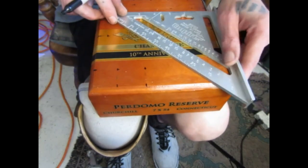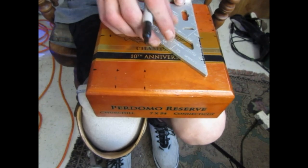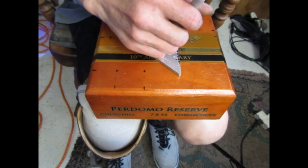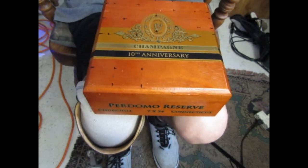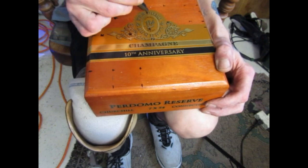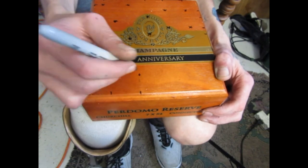When you're done it's always a good idea to go back and clean up your markers and make sure that you got the right spot. When you're going to drill holes, you want to make sure that you create a little bit of a pocket or divot for the drill bit to rest in, so that you'll make an accurate hole and you don't get a drill bit skipping around on the surface. Not everybody knows how to drill a hole — this is how we learn. So in short: find your position, mark it, carve a little bowl shape, rest the drill bit in that bowl shape, and commence drilling. That's how you drill an accurate, straight, proper hole.